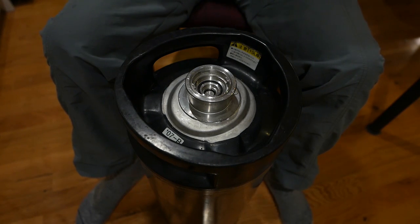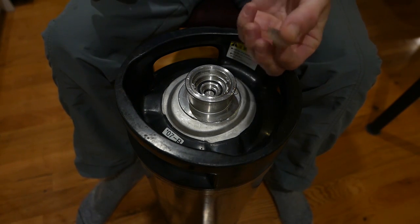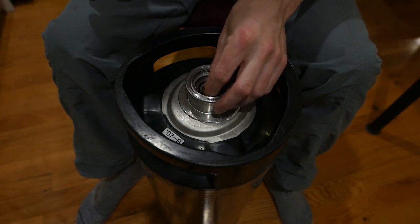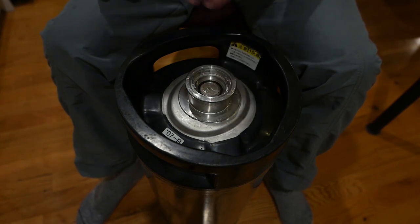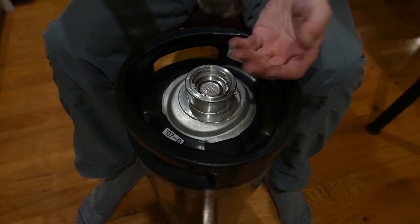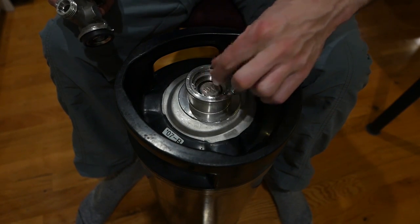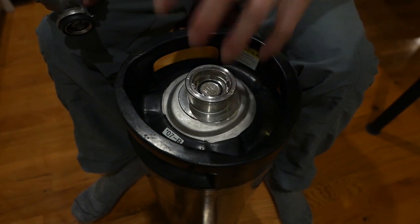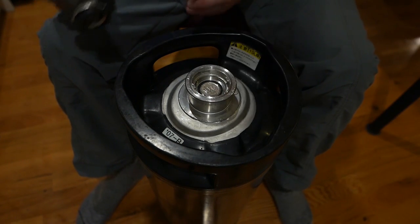What we want to do here is take a 10-cent coin — an Australian one, though it doesn't really matter what currency you use. It just wants to sit inside that ring there, so that when we put the coupler in and press it down, it puts pressure on the outer assembly rather than the inner assembly. When that outer spring mechanism is pushed down, that will cause the safety latches to retract and we can remove the spear.